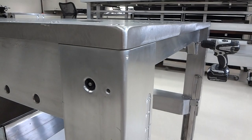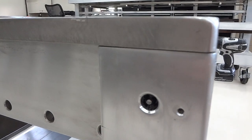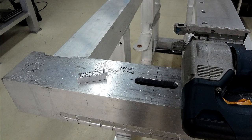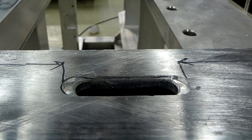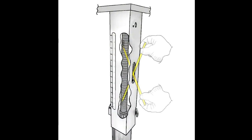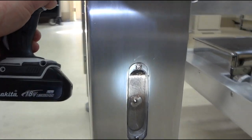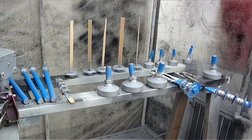On the outside, each post has a grease zerk. It'll feed all three needle bearings for the shaft. Below that, access holes were cut, step milled. This way you can grease the shafts full top to full bottom, and with a Lexan in place, they become sight glass.